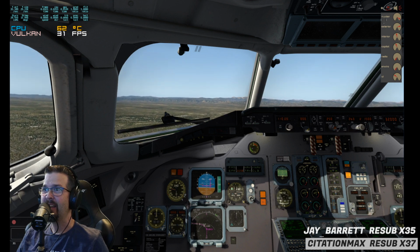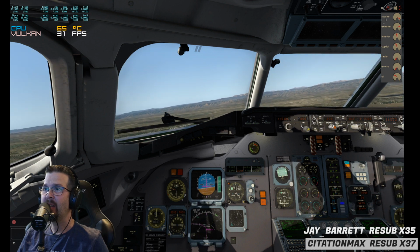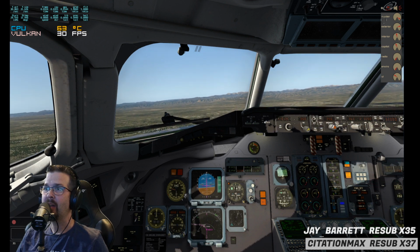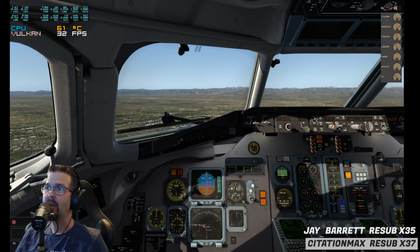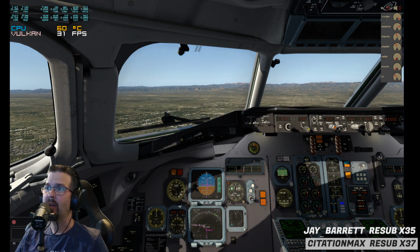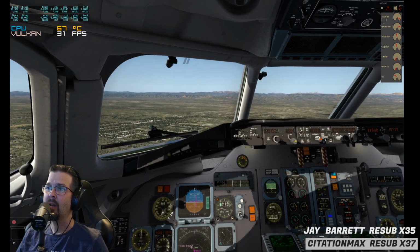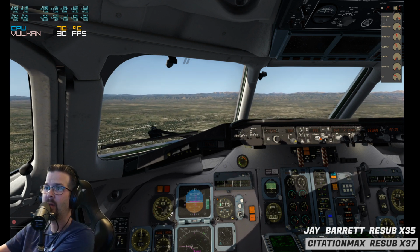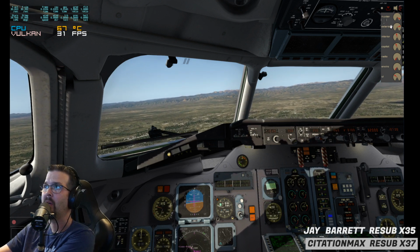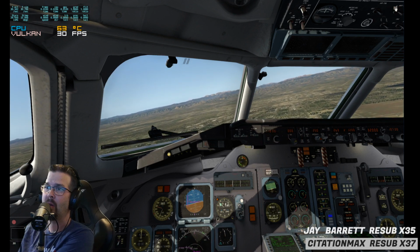Okay, now, one of the things we do after we take off in this thing, I don't know what happened that caused that failure. I didn't see it. But once normal climb, once you rotate, you get the gear up, you get to 1,000 feet above the field elevation, you go half rate, which means when you look at your vertical speed, it's probably about 3,000 or 4,000 feet. So you put it to about 1,500 to 2,000 feet. Half rate, flaps up, climb power.